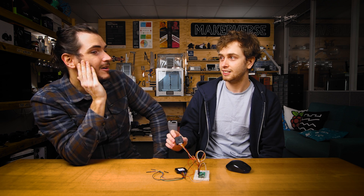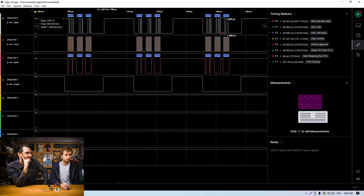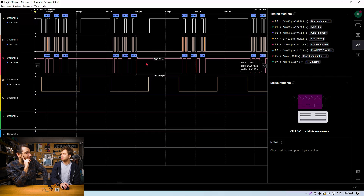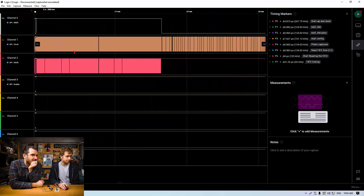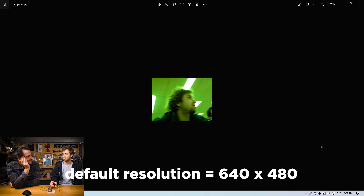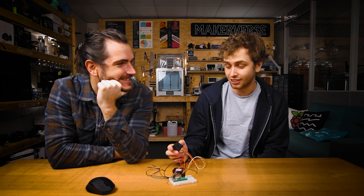There's an actual register on the camera that tells you the size of the file in bytes, because it's padded with JPEG information and such. There are a few different file formats the camera can output. We start reading out the image — there are a bunch of seemingly random outputs from the camera, but it's actually our image data. Then we have these massive block reads — happy days. But this was the first photo that came out of the camera... and it's green. Why is it green?